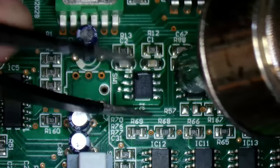And we've got op amps down near the faders for the stereo channel, so pin 1 should be an output, and of course there's nothing, but it's the inputs I'm interested in. Nothing on any of those pins up here. No, no, and no. Just noise, really. Same for both channels, which I'm finding really strange.